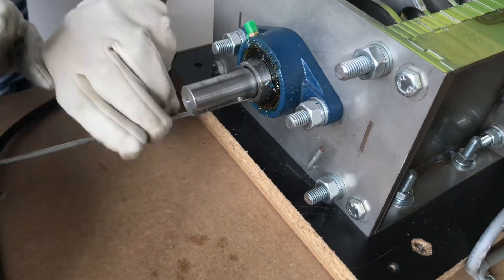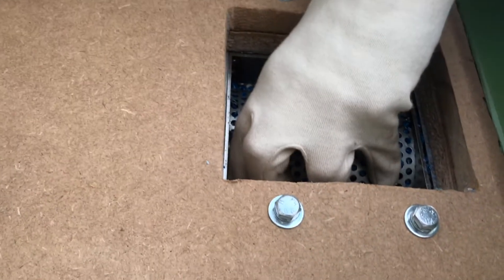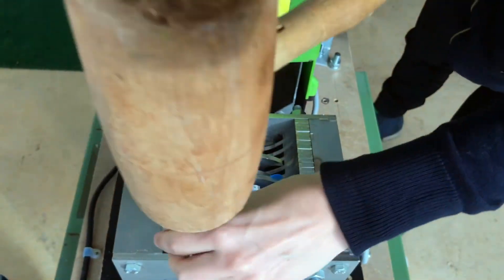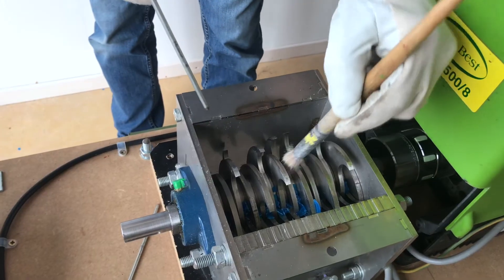To remove the sieve, the first thing we need to do is remove the two pins that are holding the sieve in the shredder. The sieve can be a little bit jammed, so we need to wiggle it out. Go with your hand underneath the machine and feel the sieve. Try to wiggle it out. If that doesn't work, you may need to apply some force from below. Just clean it as good as you can.